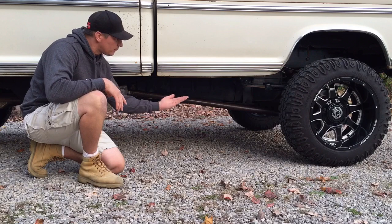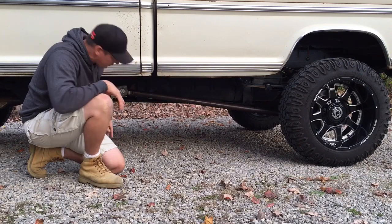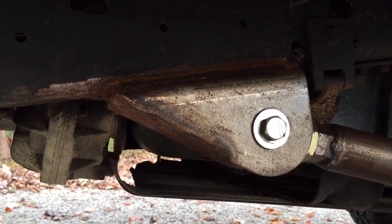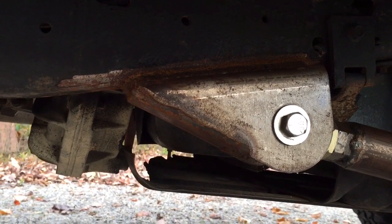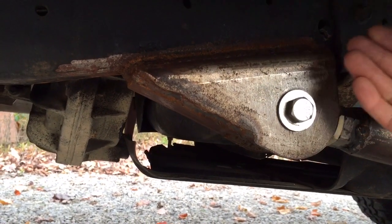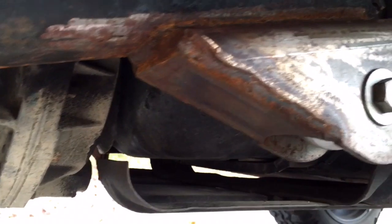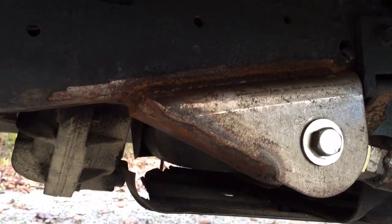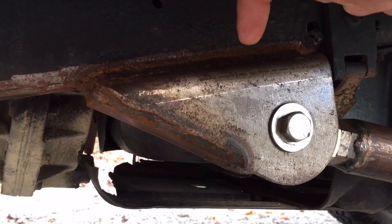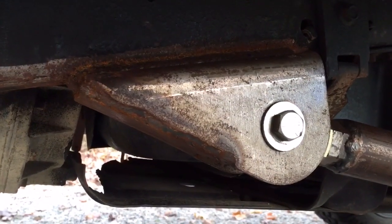Placement — front and rear, rotated forward, right back against the fuel tank straps — it's exactly where we wanted. It seems to meet a nice arc with the rear suspension, and I've driven it lots. One of the tricky parts of installing these is welding upside down — no big deal if you weld all the time, but if you don't, that's the harder part; you've got to turn your welder up higher than usual. We moved it outboard a little bit so we didn't have to get too close to the fuel tank when welding that side. Something I almost always do to these Rough Stuff brackets: cut yourself a nice big hole right in the top, either with a torch or a hole saw, so from the bottom you can do a good plug weld in case you're not able to reach everywhere around there.